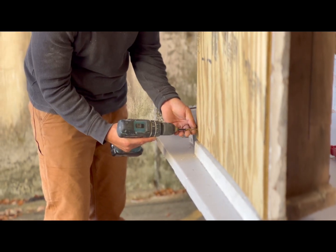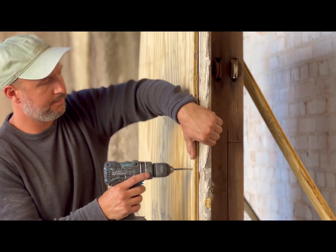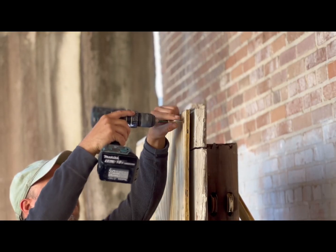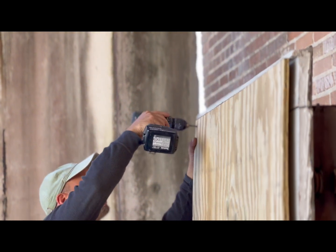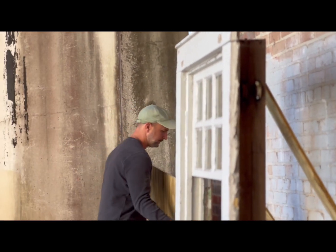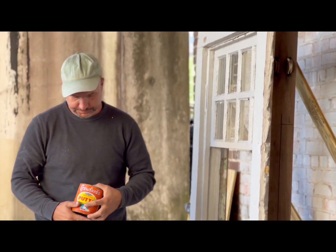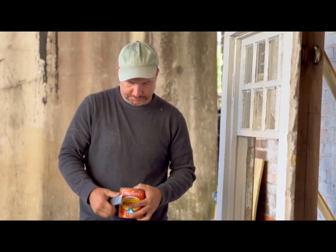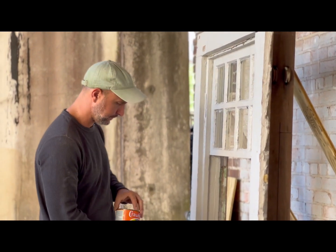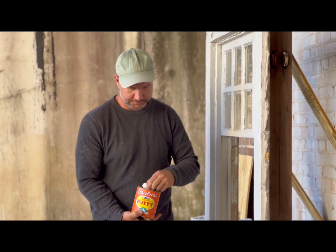Another important aspect of this process is what to do when you remove the plywood from your openings. Once the storm has passed, you can take off the plywood by first removing the screws. If you plan to reuse the plywood, make sure to store it in a flat, dry place. Don't forget to fill the holes left from the screws. It is imperative that you fill these holes, as unfilled nail or screw holes in window trim can lead to moisture intrusion, rot, or failing paint.